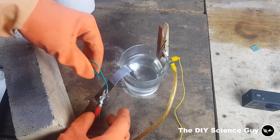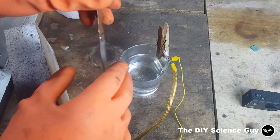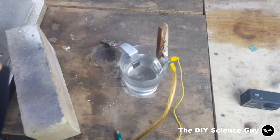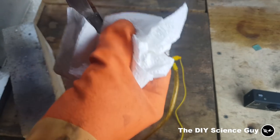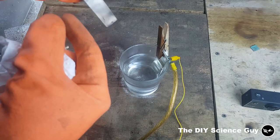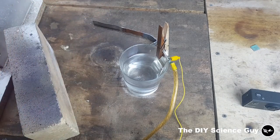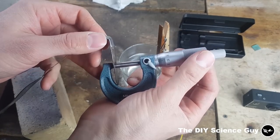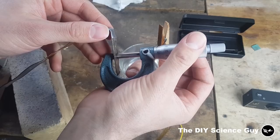It has now been running for about 6 hours. You can see there's a little bit of blackness on it — it's probably just a tiny bit of nickel oxide. Of course there will be a bit of oxidation occurring, but because nickel has such a high resistance to oxidation it will be very slow, making it very suitable as an electrode. There occurred so little oxidation that the nickel layer didn't even decrease by a measurable amount. So this is what I'm going to use in the next setup.